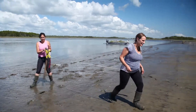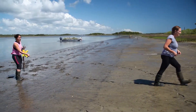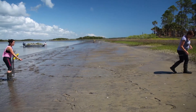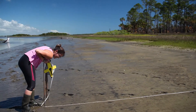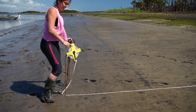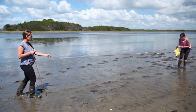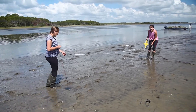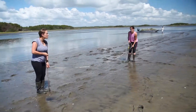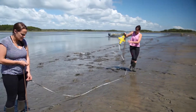To mark the position of the breakwalls, you have to measure 20 feet out from one edge of the shoreline that you've previously marked and mark that spot with a rebar stake or a PVC pole. Then you have to measure 14 feet from that stake parallel to the shoreline and mark that end — that will be the entire length of your wall.